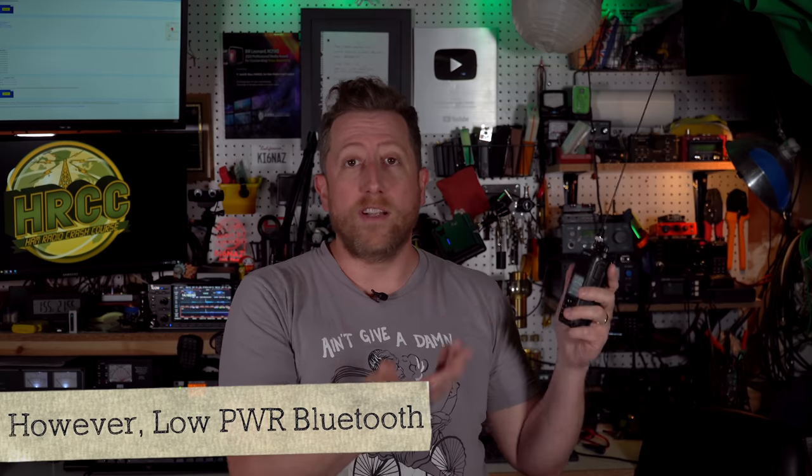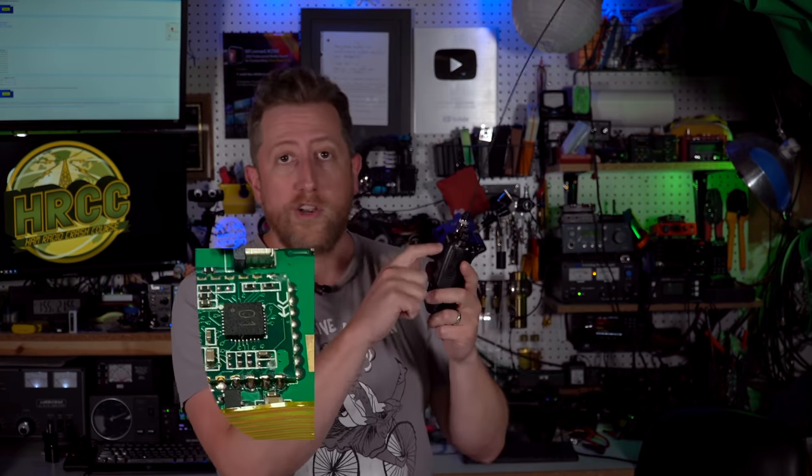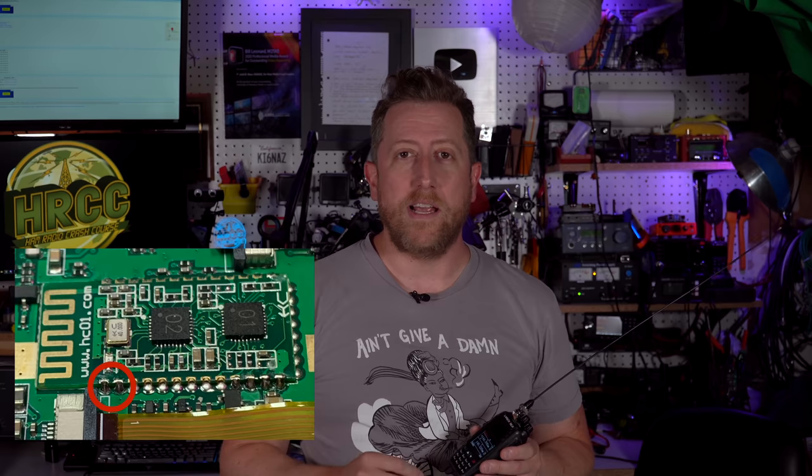Out of the box, this should just work with APRS — it should be able to Bluetooth from your tablet into this radio and just beacon on its own. However, there were a couple of these that had poor soldering connections to the Bluetooth card inside. I actually opened this thing up, put my magnifying glasses on, and just touched up two spots with a little bit of solder on the TX and RX side of that Bluetooth card. And bam, this started working APRS over Bluetooth.